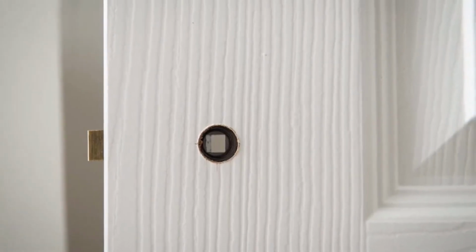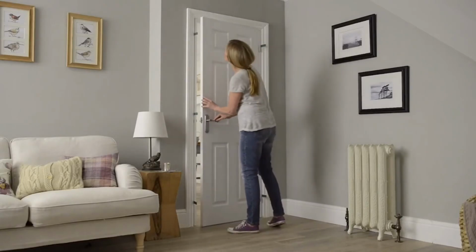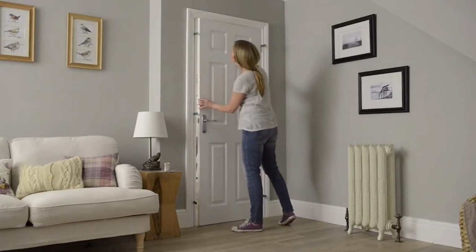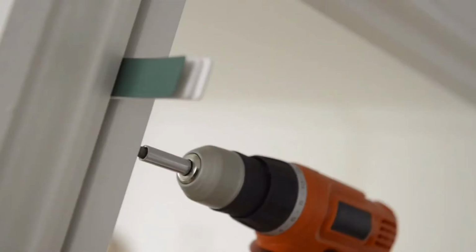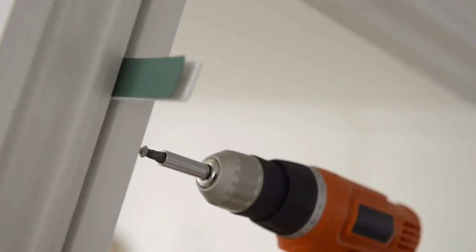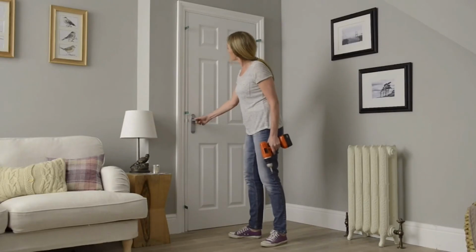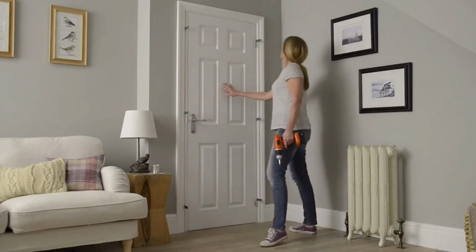Fit your handles onto the door, which is pre-machined for the latch. Try closing the door to check it fits correctly with the new frame. Your existing frame may not be totally square and may not close correctly. In this instance, you may need to readjust by loosening the 50 mm screws off the frame strip, adding or removing packers if necessary, and retightening the screws. Repeat this until you are happy the door closes correctly. Take care not to over-tighten the screws.